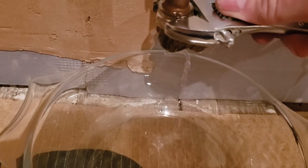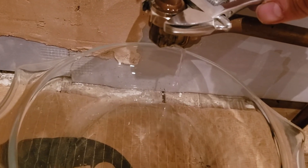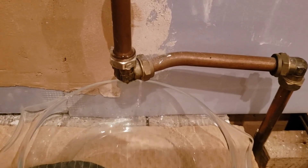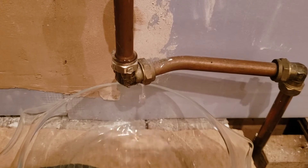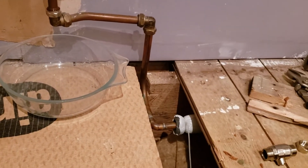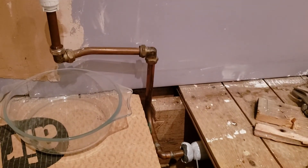Water's coming out. It's been about 15 seconds, no sign of slowing. I'll just tighten that up again. I'm going to pause the video and pierce a hole in that, get spraying - I've got a glove so I don't get a cold burn. Then I'm going to wait five minutes after I've finished spraying for the ice plug to form, then I'll restart the video and we'll see what happens.